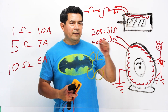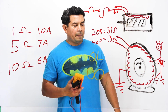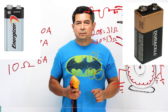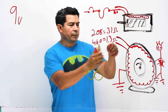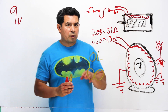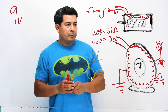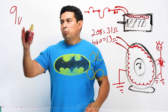You can check the resistance on the windings, and then you want to see if you have any connection or resistance between your wires and your casing. Now, one thing about meters — inside the back of these meters you're going to have a nine-volt battery. That means when we hook up the leads, we're pushing the electrons through with nine volts. Because voltage is pressure, we're pushing with nine units of pressure. But this motor is running off of 208 volts — the connection may be so small that 208 volts can push through it, but nine volts cannot, because it's just not enough pressure.